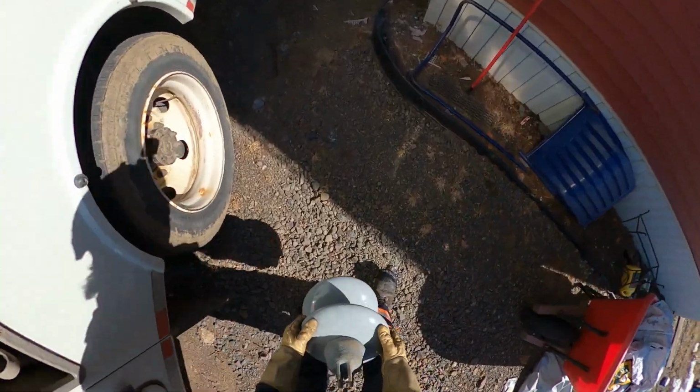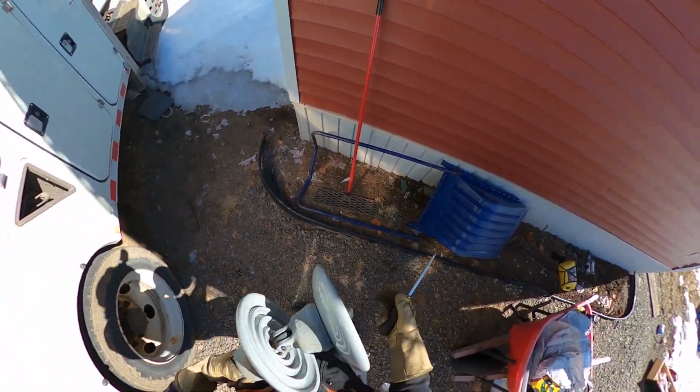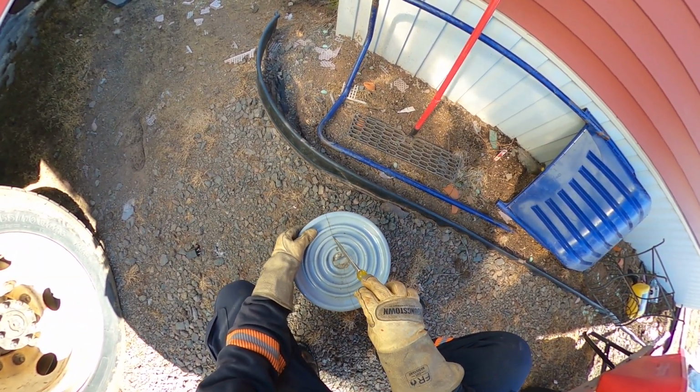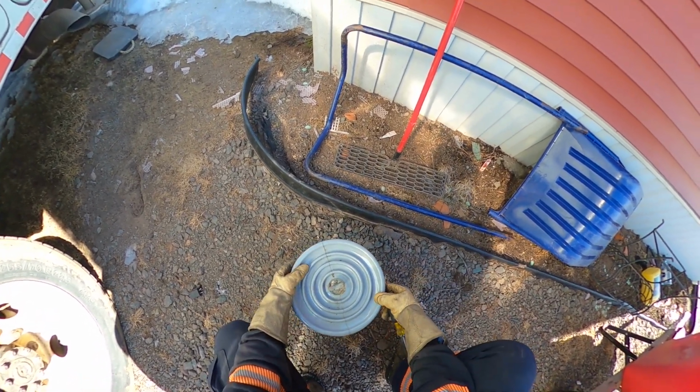These bells, before we go, little job from yesterday. These are dead end insulators, and from the ground I can see that crack. It's quite a bad crack. I can see it from the ground, and I confirmed with binoculars that the dead end unit was cracked.